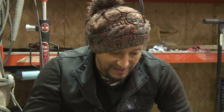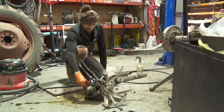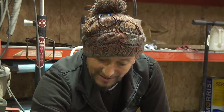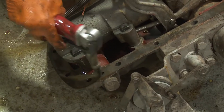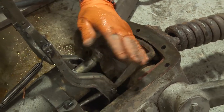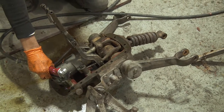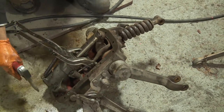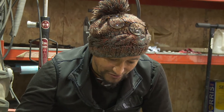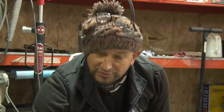Just as a little experiment to see if any seals on the piston are still operational and to see if all this gear moves, I'm just going to try it with a little bit of air. I'm using compressed air where hydraulic oil would ordinarily push through. If I push air in through this orifice it should push the piston down, which will push the push rod against this little cup here, which will then pivot these arms around. And that is operational — our piston and cylinder seem to be in pretty reasonable shape.